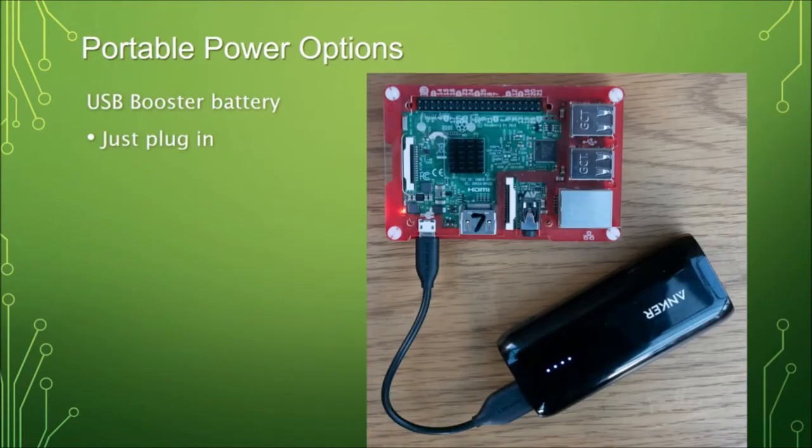Finally, we need to solve power. A really quick and simple way is to get a USB charger pack. These are nearly all based on batteries called 18650s — 18 millimetres in diameter and 65 millimetres long, like a big chunky AA battery, about twice the size. A two-cell pack will have two of them. The single-cell ones often can't power both the Raspberry Pi and the motors. The two-cell ones have enough juice to sometimes power small motors, and will run a Raspberry Pi all day and beyond.